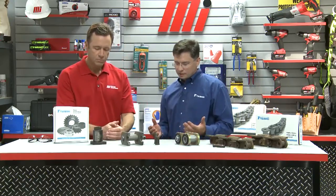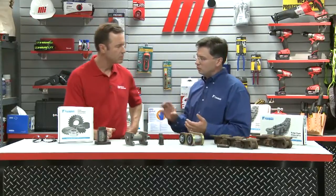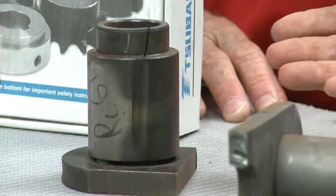So where are we going to start on the table today? Well, first I'd like to explain that normal chain wear occurs between the pins and the bushings. As the pins and bushings wear, the chain stretches or elongates — that's called elongation or chain stretch. If the chains have rollers, the rollers will also wear and become sloppy, and that's normal.